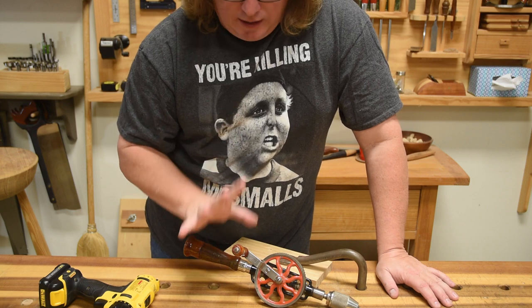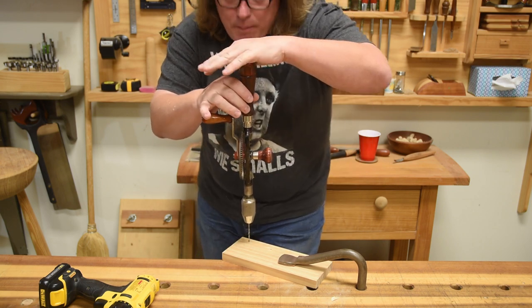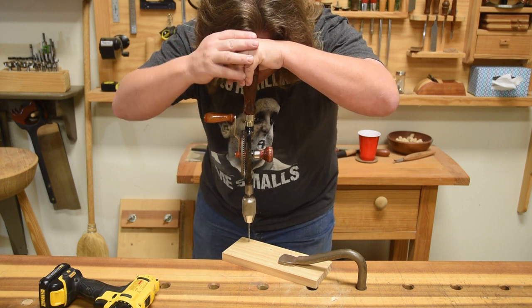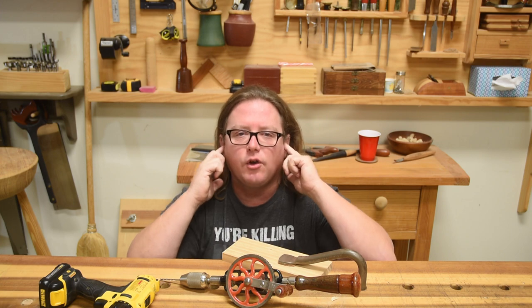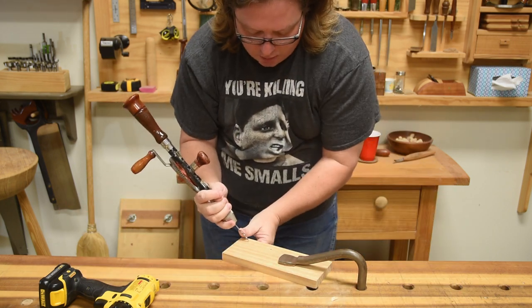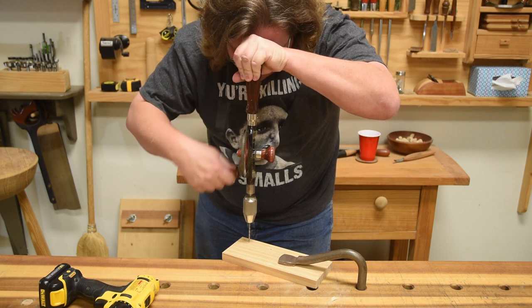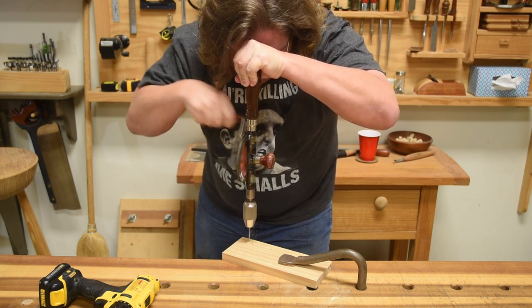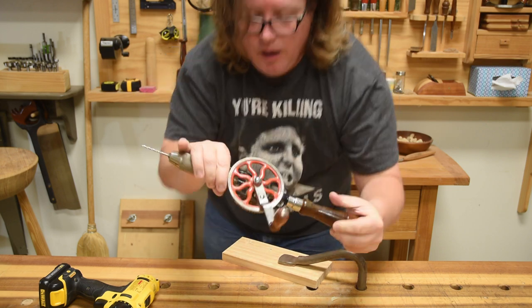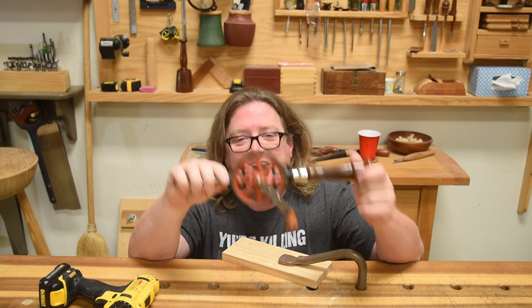How many points of contact can you have with a hand drill? Most of us will put it on the board, find its nice balance point, and then put your forehead on your hand. That way your feet, your forehead, and the drill become multiple points of contact. The reason you use your forehead is because you're taking advantage of your ears — your ears can tell even the slightest bit of motion, that's why we can stand up. So if I put the thing on the board and put my forehead right there, I can stabilize it. Making one revolution backwards to let the spurs score a nice hole, then just going forward — not putting any weight down, but my forehead controls that it goes straight down. It's amazing how much more accurate you can get a hole with these old-timey egg beater drills. I suggest you pick one up and try it out.